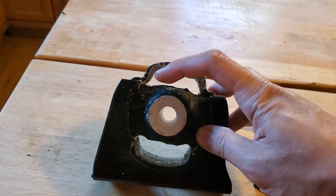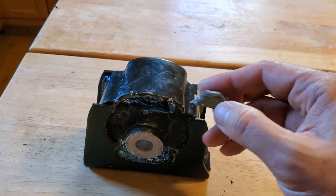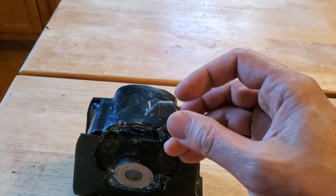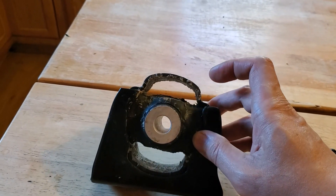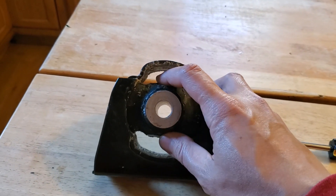I've also cut the rubber stops off the top and the bottom. The reason for that is when you have the polyurethane insert in there, it's going to be thin in the middle. When it presses in as you go to accelerate, it's going to want to press out. I feel it's just going to split that insert in half and shoot it out the sides. So this will at least guarantee that that insert will be nice and strong.